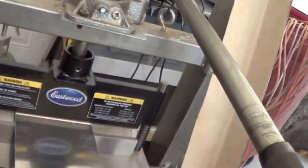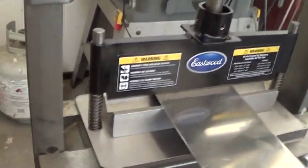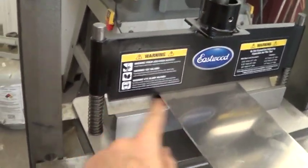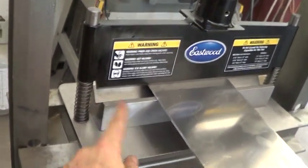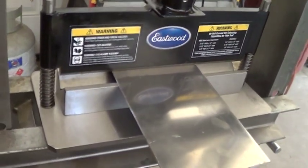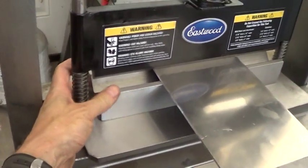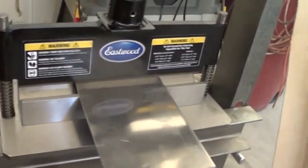Here's an eighth-inch piece of aluminum and we're going to put it in this little tiny press brake from Eastwood. This is a punch — it's kind of a v-shaped thing — and it presses down on this aluminum and this die, which is also a little v-shaped thing, and then it bends the aluminum. The amount of force required to bend the aluminum is related to the thickness of the aluminum and the width of this die. The wider that is, the easier it is to bend.